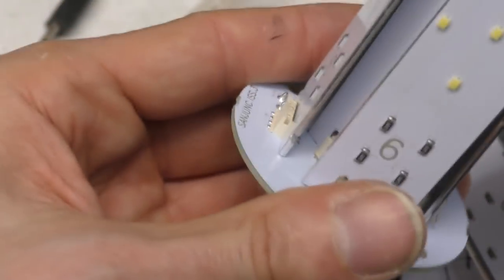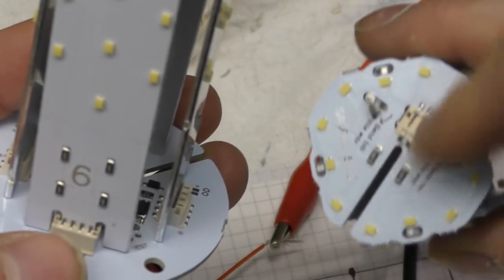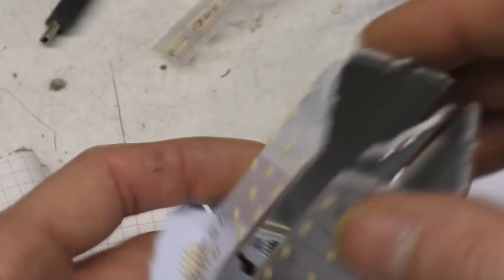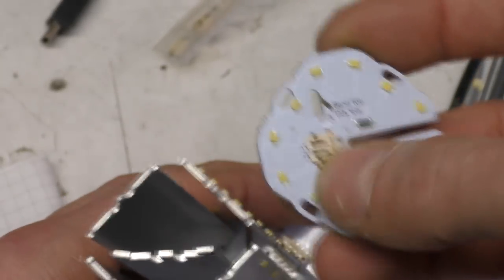And one other little detail, I actually used the 4-pin connector here. This was really just for mechanical reasons. I used the 2-pin at the top because there wasn't space for the 4-pin. It just gives them more grip, so that when this is being pre-assembled, it holds these slightly closer to the ideal position, which makes it easier and quicker to assemble. We could probably have got away with the 2-way ones, but this makes the whole thing easier to assemble. It holds these in almost exactly the right positions, whereas the 2-pin ones were quite a bit more wobbly. Obviously the one on the top doesn't matter as much, and it's also a different type because it's a through-board.